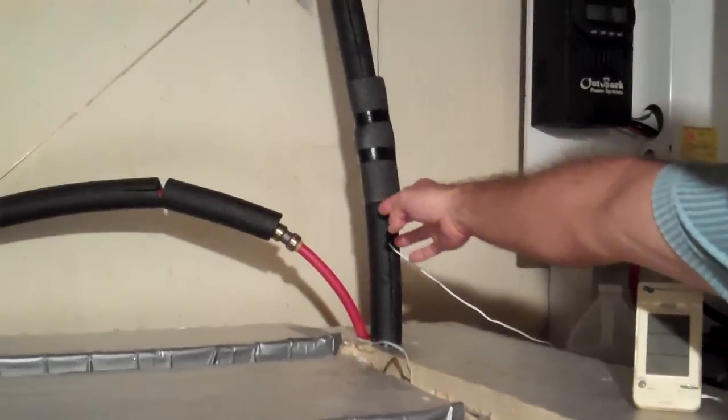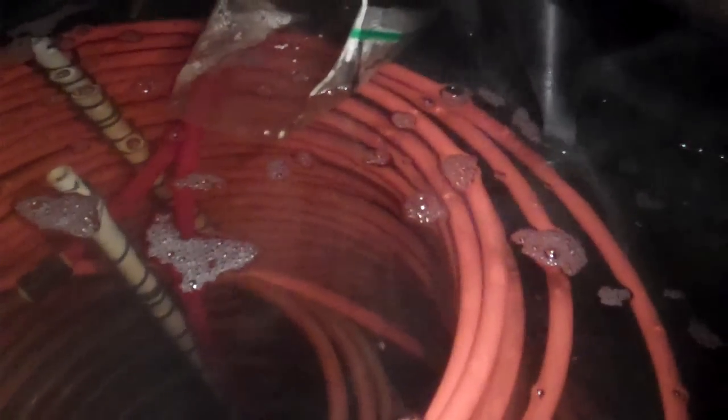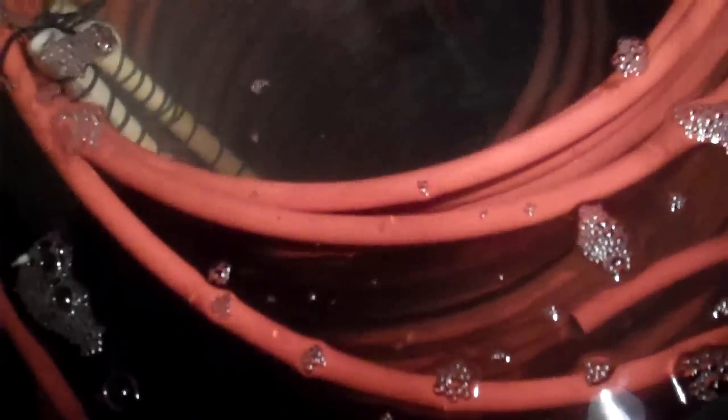That's entering the tank by this tube here. We have 140 degree liquid coming back from the solar collector out in the back yard. It's entering this copper coil, which is the smaller coil inside our thermal storage tank — again, 200 gallons of water. The orange pipe, that's pex pipe — that's simply water that has come from the town before it goes to our conventional hot water system. So our hot water is preheated and then goes to the conventional tank. If the sun's not shining, it's not a problem — the conventional tank does its job.